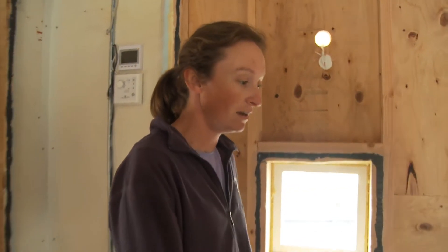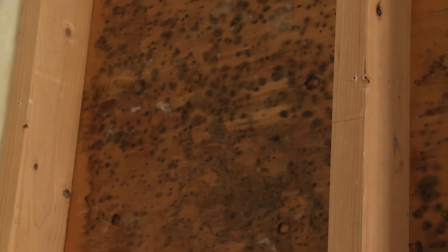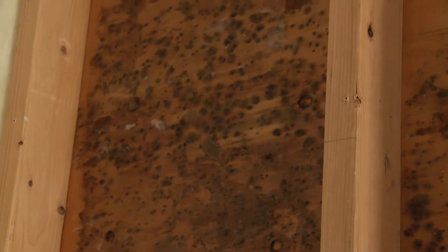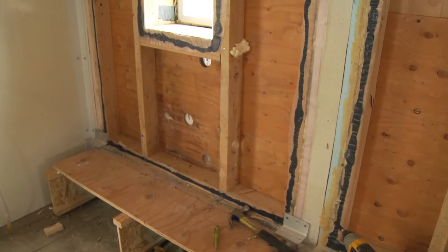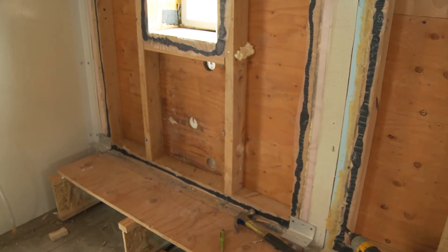This wall — all the walls got wet the first winter we did this. They all had moisture in them, but for the most part they dried pretty quickly. This wall didn't have a vapor barrier, and it obviously didn't have enough insulation on the outside. Wall nine did have a vapor barrier, and if this one performed this badly, we expected nine to be even worse. But it's not coming out that way at all.